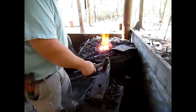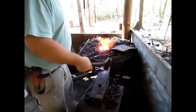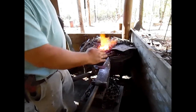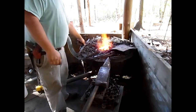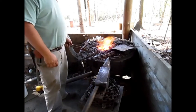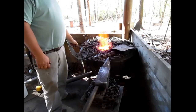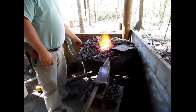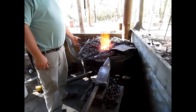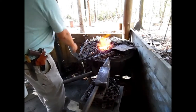You need to remember which side is top. So when you're forging, you keep that flat top and the beard going downhill. The beard always goes downhill. There's a lot of slag in this fire right now — I'm going to end up taking a break at lunch and restarting the fire, cleaning out the slag.